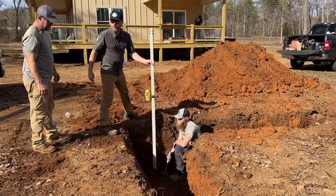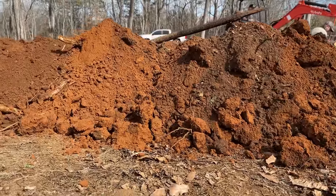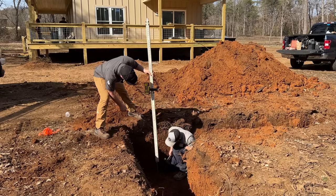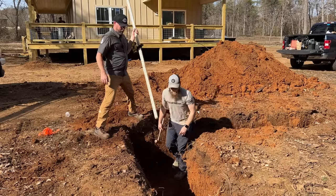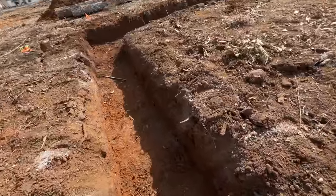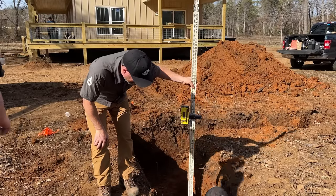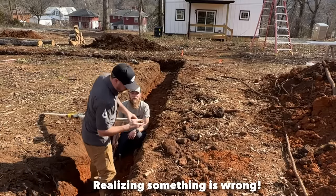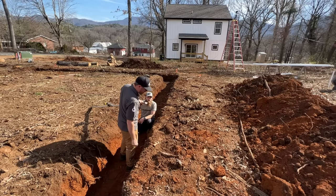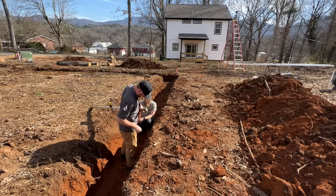Something's not right - the dirt's in the way. It's about two inches down. We're putting these about every five feet; that seems to be a good distance for putting the concrete in. There's like an inch of dirt on the bottom of our grade stick - we've got to redo those.